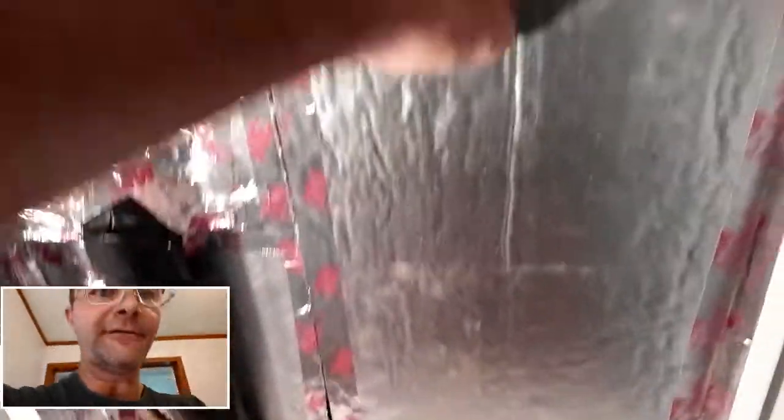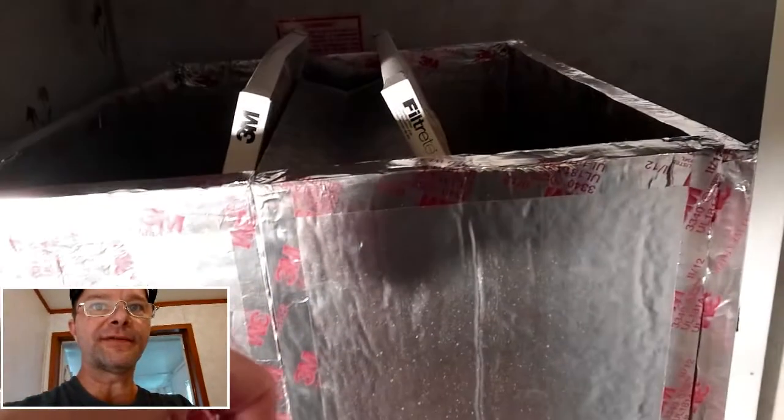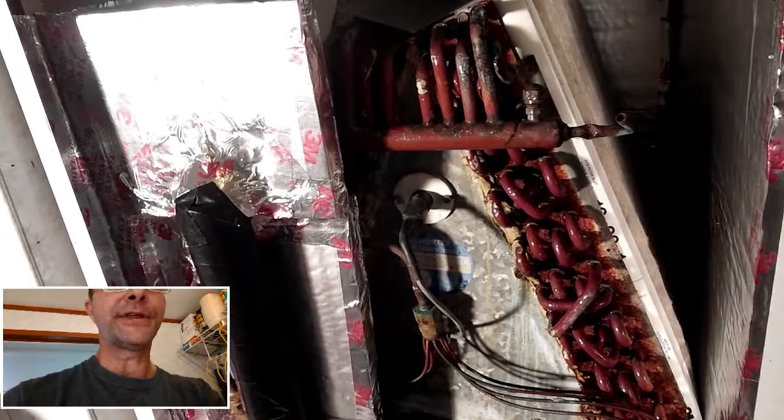I still need to replace the lamp, but that's down the line. I wanted to put a door in here — this is all sealed up pretty good over here permanently. But I'm going to put a door, as you can see, I've just kind of cut it and sealed the edges around. We'll put that kind of flush along the edges over here and work it up there. You can see it's kind of recessed down there, but I'll talk about that later. You can get this kind of taped up and sealed in with a door and have a ledge for the filter, which I'll show you all that stuff later as well. That way, I can get in here and access it, check the coil, clean the crap out of it if anything gets past it in there, look for rust, and replace the light.